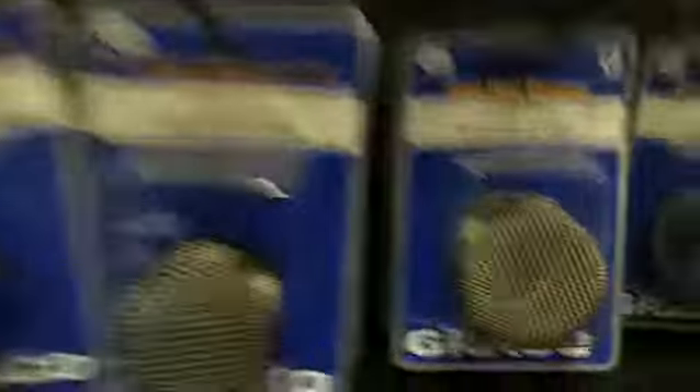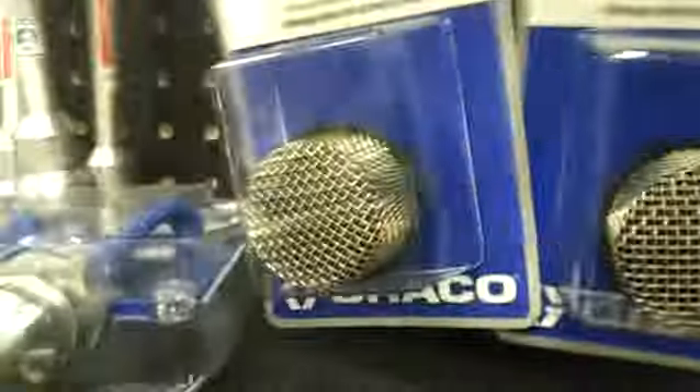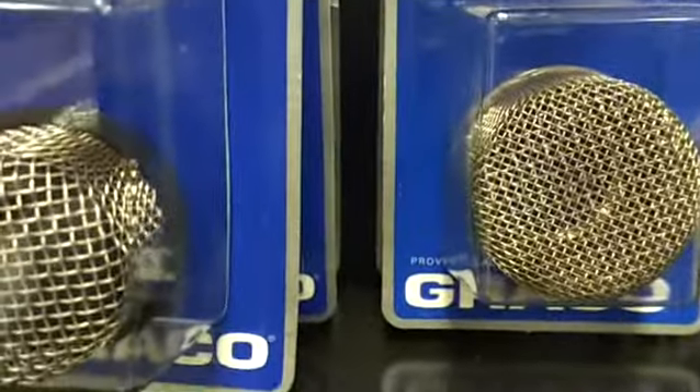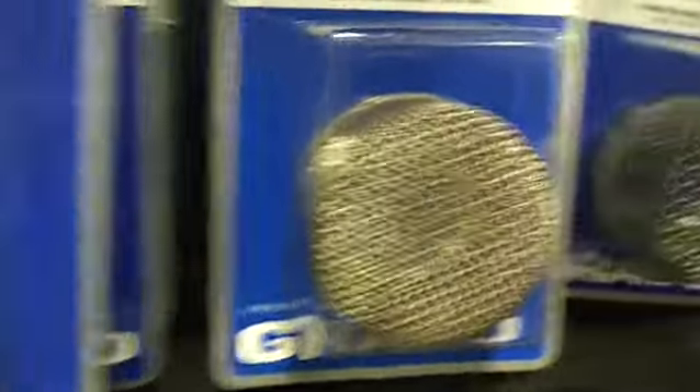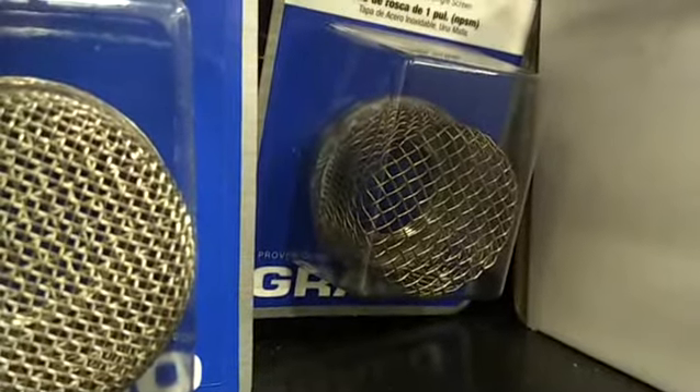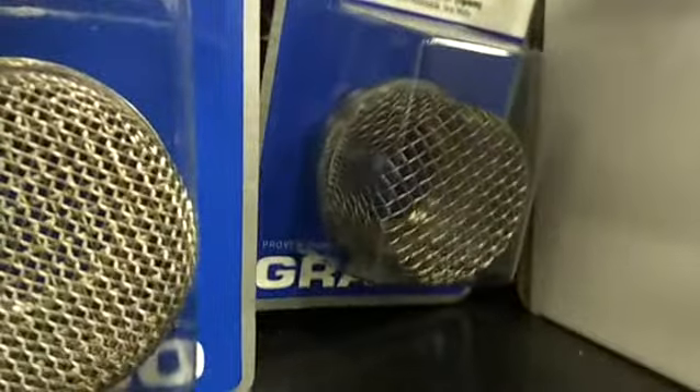The 200 mesh is for clear coats, lacquers, and your strainers. Your strainers for your 395 to your 595, and ones for your 695s and above. That's a little more fine and I believe crush proof — but you shouldn't be crushing your strainers.